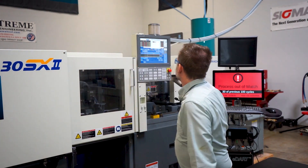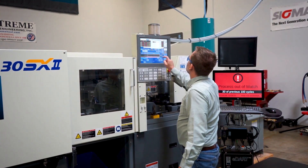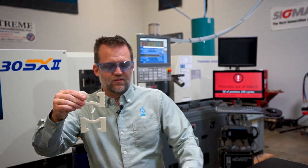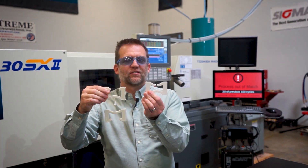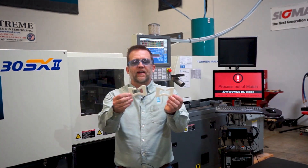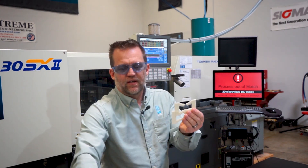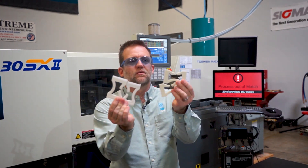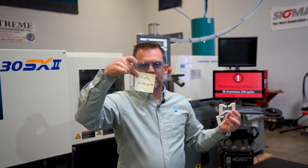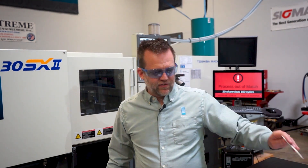So let's wait for that new shot size. What I did was add more shot size, because the current fill was a lot smaller than my documented sample. I need to make my fill only look like my sample. This automatically looks way better — it looks more like my sample. Here's my sample again; they're about the same. Let's throw it on the scale. The target weight should be 10.56 grams — and it weighs 10.56 grams.